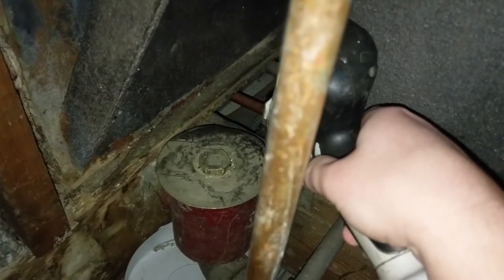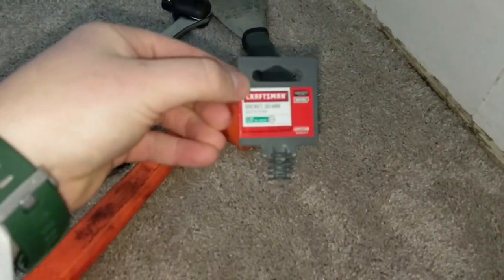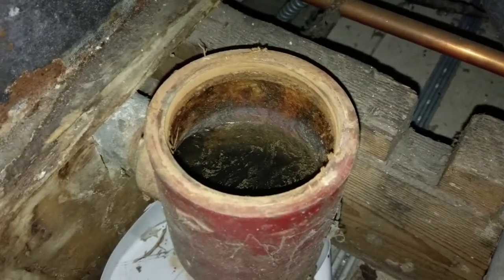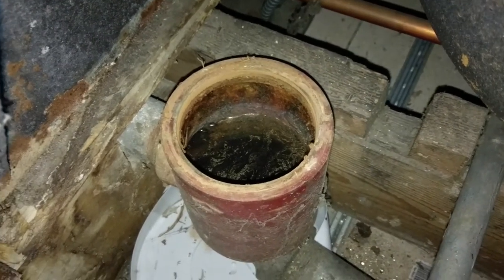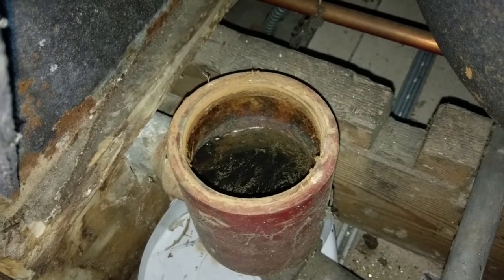You can see it's a little chewed up from using the monkey wrenches. This is also a 32mm socket - I think the actual nut size is inch and a quarter, but I could only get inch and three-sixteenths. They didn't have inch and a quarter - it was the one socket they didn't have. Anyway, it looks like the drum trap itself is clear, but somewhere down the line is not, so the next step is I have a little zip-it. I don't know if it'll reach far enough, but I'll try it first and if that fails, I'll get a longer one.